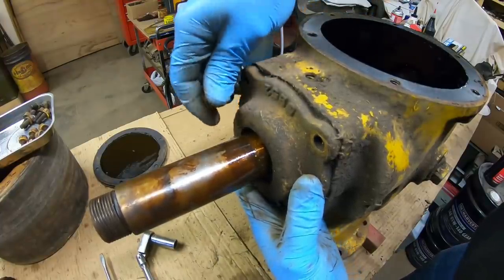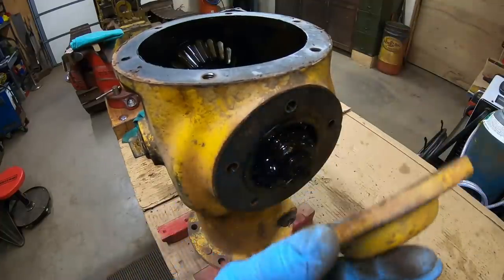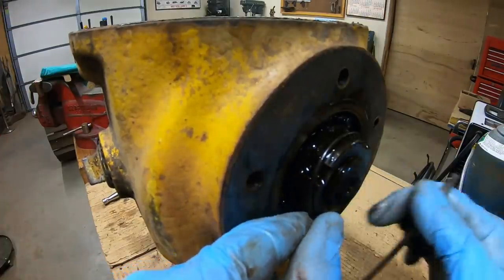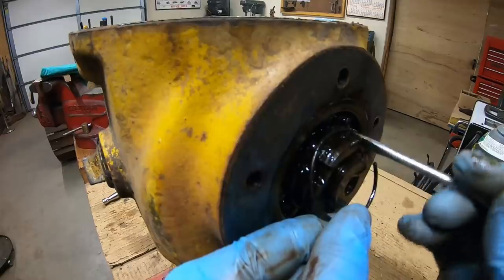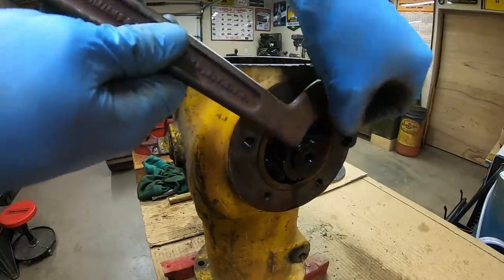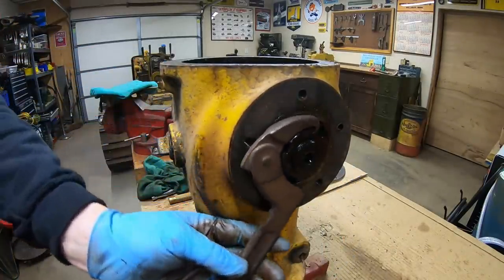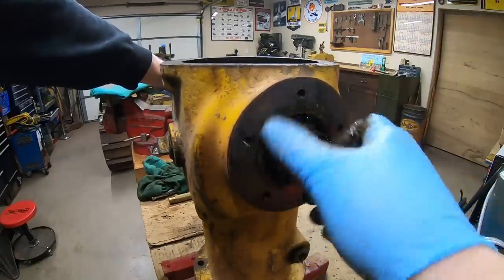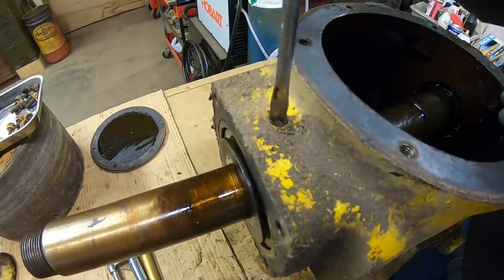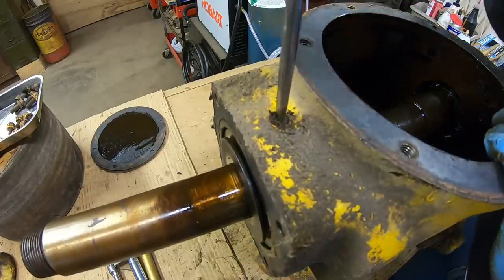Take both of the main shaft bearing cap covers off next. Next, we've got this spring lock on the spanner nut. Get it out of the way. Spanner nut comes off now. And then this set screw, this is what locates and retains the outer Hyatt bearing race.